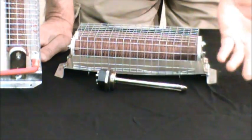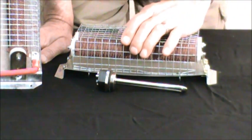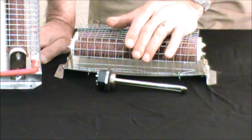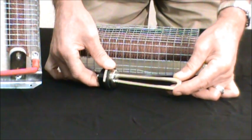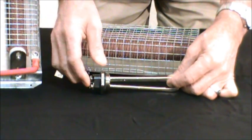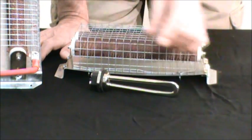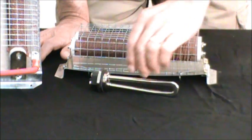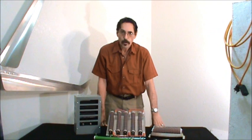You don't have to dump your wind turbine over to a set of resistors. These resistors do put off heat, and if it's in a small room it'll actually heat the room up. But you can dump your load over to a DC water heating element. We've got all kinds of these adjustable thermostats and setpoints — these will fit a standard water heater. When the load is diverted, you can heat hot water with it. I hope that explains dump divert loads for you.